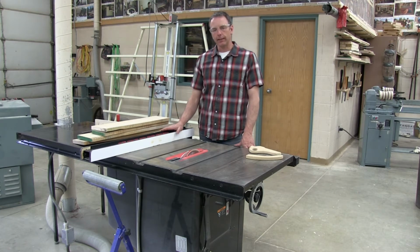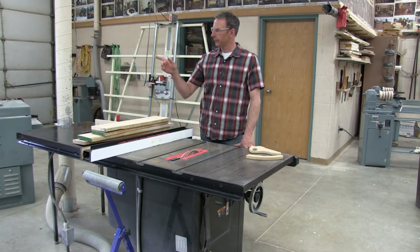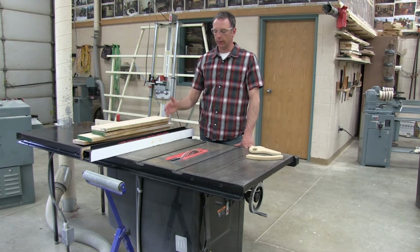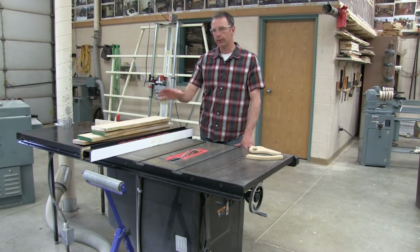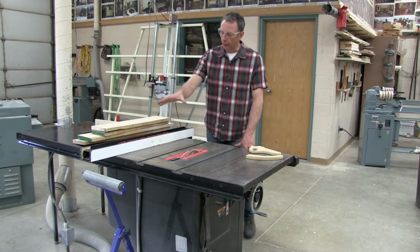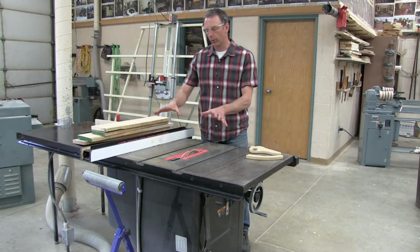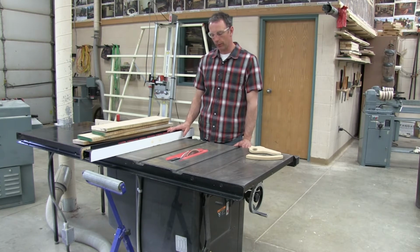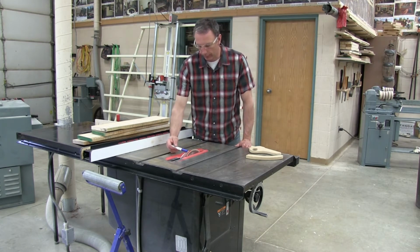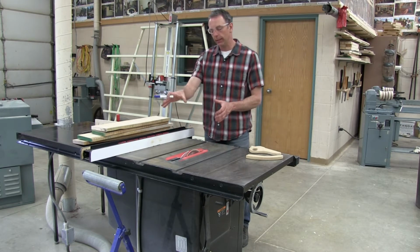So the table saw is very versatile, but it's also quite dangerous. It has two types of dangers, just like the crosscut sliding miter saw. It can cut your fingers or hurt you with the tool, but it also has board kickback. So instead of the machine coming back at you, like the sliding miter saw, it has material kickback. And material kickback can happen straight back, or it can happen sideways. So if we have a larger piece of wood and it torques away from the fence, it can catch and go sideways on us. And there are different things that we can do to prevent that from happening. For one example, we have a riving knife on here. This riving knife helps prevent that sideways kickback. It also keeps that saw kerf open so that it doesn't collapse in on the blade and then come back at you.